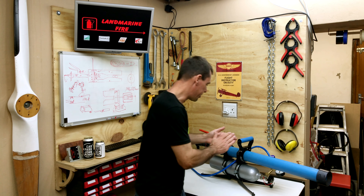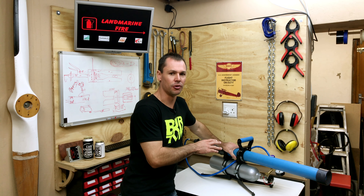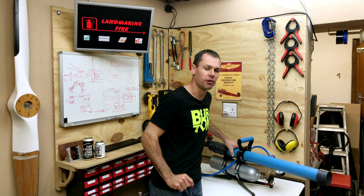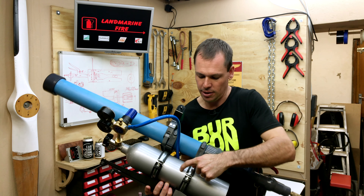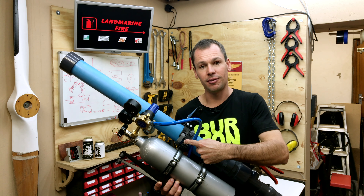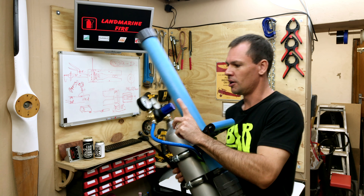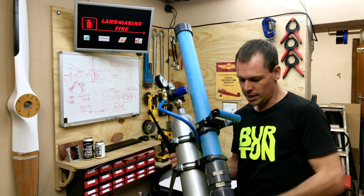Back to what we came for. This is the T-shirt cannon that I made a couple of episodes ago. We have added a nice storage tank - it's a little bit easier to use now compared to lugging the big old compressor around. We just took a CO2 canister, added some gutter brackets - 110 mil and 75 mil brackets - a nice little regulator, and some tube. It's actually turned out quite well. I have dry-fired it, but I haven't actually tested it firing with a projectile in it. And there's a reason for that - we're going to do a small challenge involving a golf ball and two of my mates.